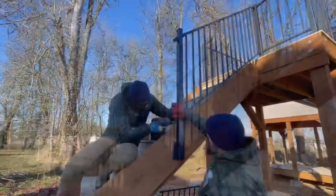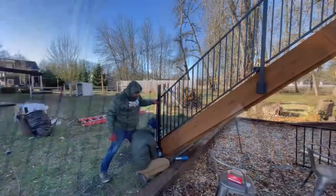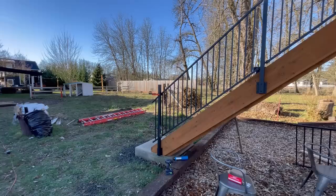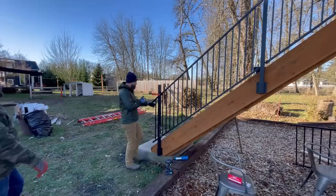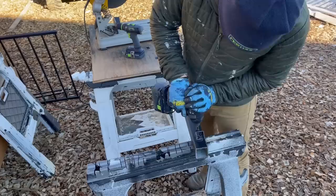After cutting that little bit of material off on the bottom, we added our brackets and stuck the whole thing back up just to make sure it would work. Now you can see those brackets are touching on the bottom and the top, everything's level and parallel to the post — we are good to go. So we marked onto the post where the brackets needed to land, bolted the brackets to the post, then bolted our railing to those brackets. Then we hooked our post on the lower section of the stairs, leaving the railing just loose. Then we did something incredibly smart — we just clamped the railing to the post. This gave us the exact angle needed to cut the railing and showed us exactly where we needed to mount our brackets. In hindsight, we should have just mounted all of our posts, clamped the railing on the outside, marked it, and cut it — we could have foregone all that fumbling around. So if you ever do stairs with this railing system, just put your posts up first, clamp your railing to the outside, mark them, cut them, install them. It's that easy.